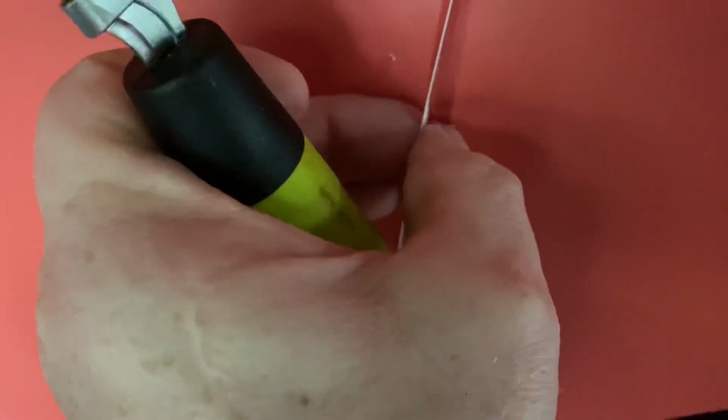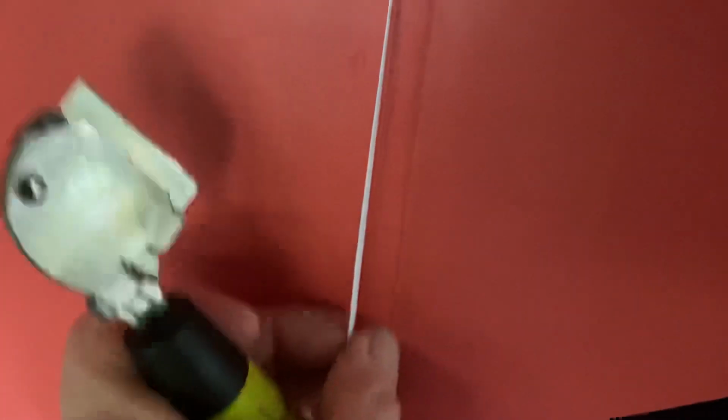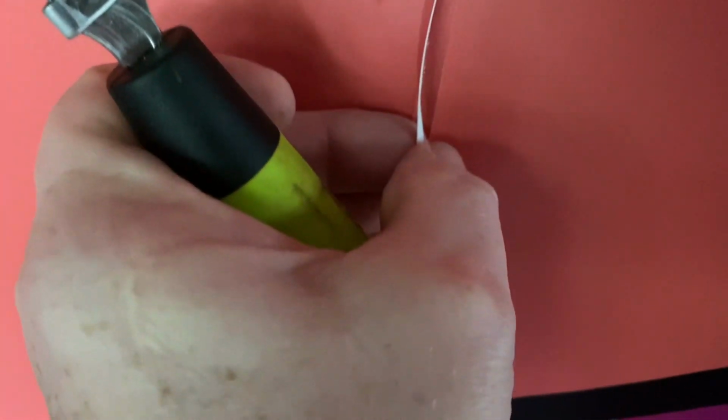When I say seams, I mean both sides of that seam. You've made it necessary. You've created a ramp, a microscopic ramp on one of the sides because you have shaved off some of the top of it. If you look up close to a bad cut, you'll see that some of the surface at the top has been shaved off because of the angle at which you cut the seam. That's what's happening when you cut through a solid color of wallpaper and there's nothing going on in the pattern to hide your bad cut.